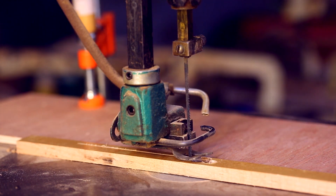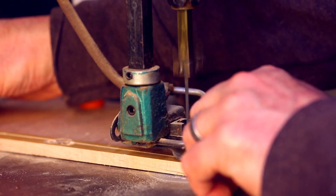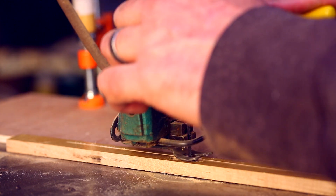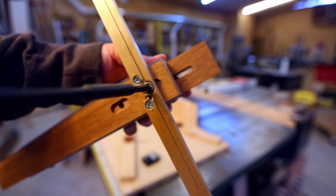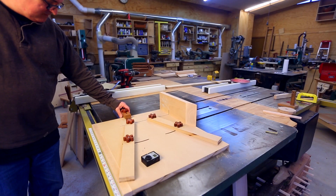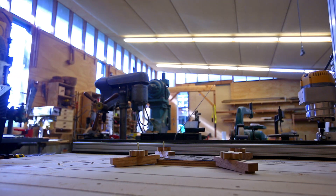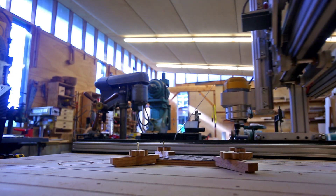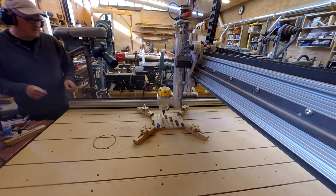I cut a slot into the runner to let the wood expand as the bolt gets pulled into the countersink. I used my scroll saw with a fence to get a straight cut. You can see how the countersink pushes into the hole and widens the wood, which will hold it in the slot so it won't move when a segment is against it. Then I got a small piece of plexiglass and cut a gauge on it with the CNC machine.